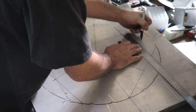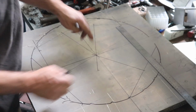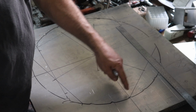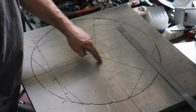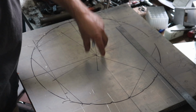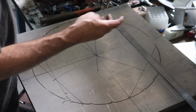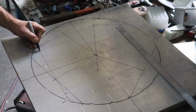And this is rough machining to get basically just a T-slot started. After that, I'm probably going to machine a precision reference circle while this plate is on the mill, and then another dowel pin out here that will key into the center slot of the table. And the table has like a 2-inch pocket as well, so we'll make a dowel that fits in. That way I can repeatedly put this table on and off, and hopefully my T-slot holes will be loose or tight enough with this manual measuring to just continue to use them.